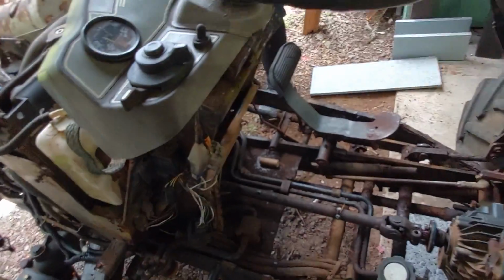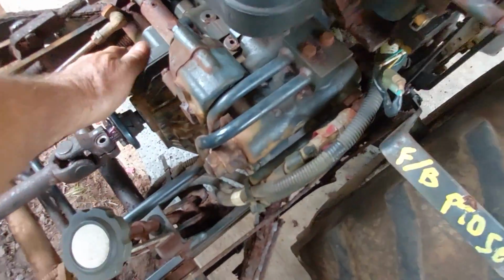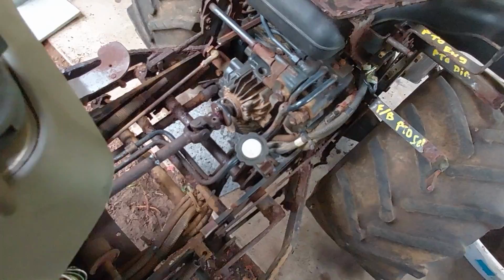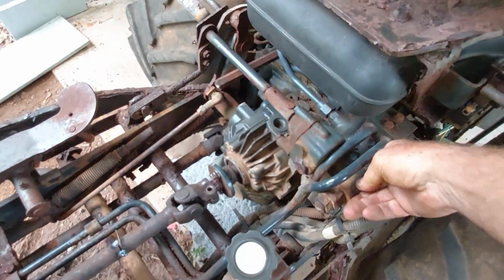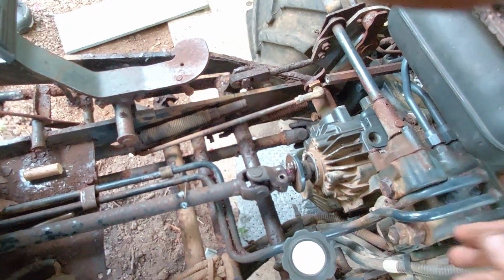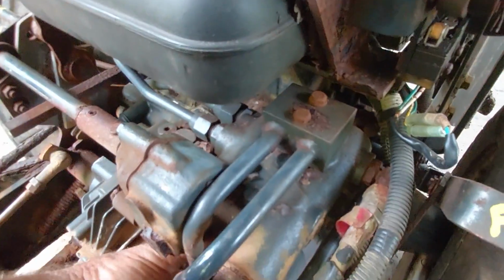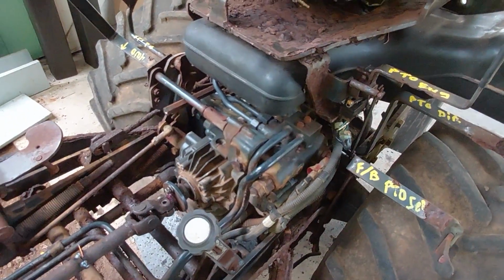Okay, so the hydrostatic drive, after doing that, it's pretty warm. So yeah, it definitely needs that fan. The control valve up here is pretty toasty. And not toasty, just warm. And I would say the hydraulic pump is bordering on hot.